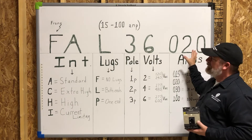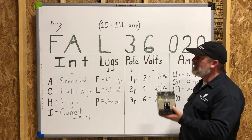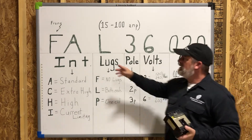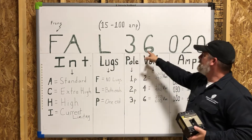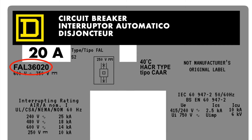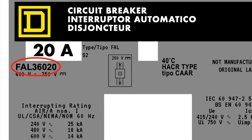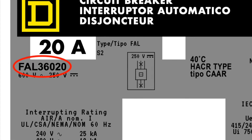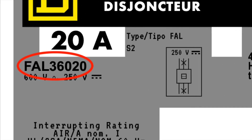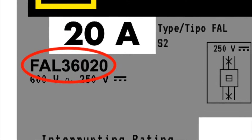We've kind of drawn out a chart for you. This is the F-frame right here that we're dealing with, an F-frame circuit breaker. The one we're going to use in our example today is going to be the FAL36020. To locate the catalog number on your circuit breaker, just look directly to the left of the operator switch. You'll see the amperage rating, then you'll see a cat number: FAL36020. It's very important that you have the catalog number to get the correct breaker for your application.